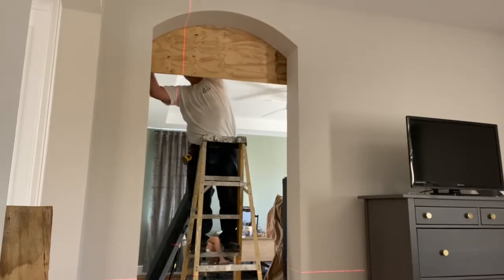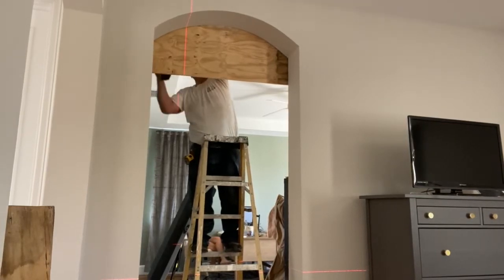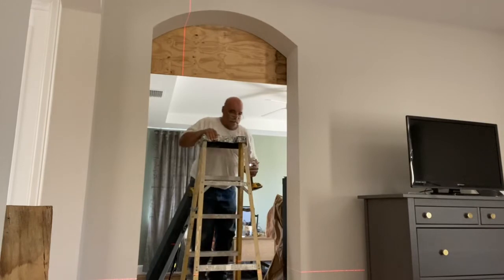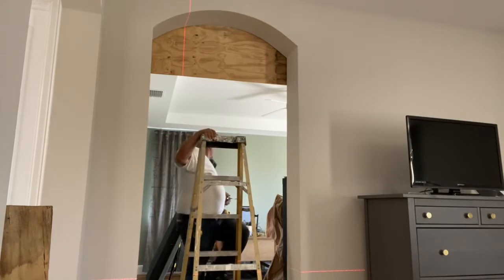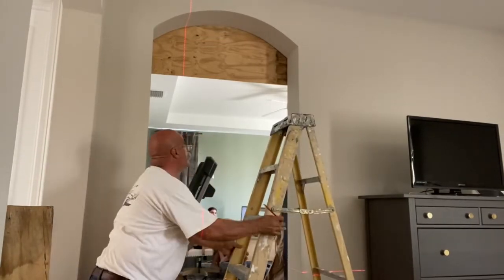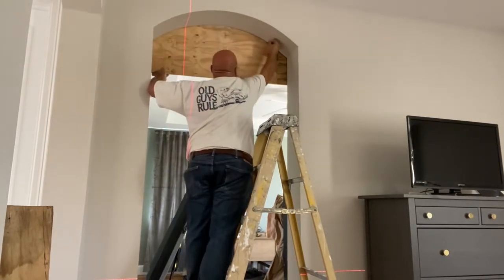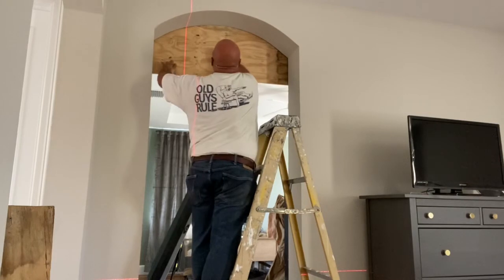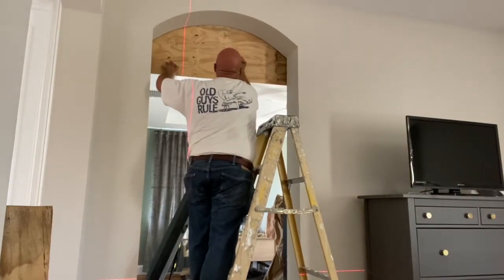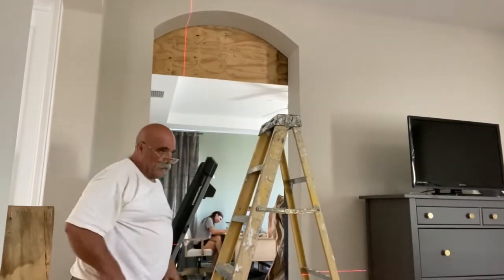I'm tacking it off and then I'm going to mark it. I thought this was going to be the easiest way — I had extra plywood laying around, so it's no big deal. Once you have the plywood in place, take your pencil and draw the vertical part and the radius. This way I know exactly where it ends when building and kerfing the plywood to go inside this arch. Let's take it down, take it home, and get started.